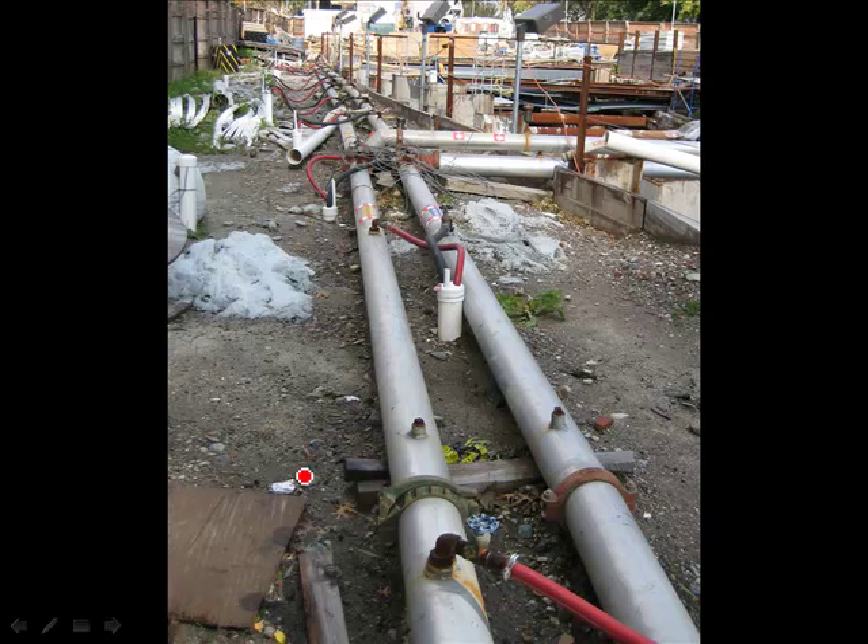This illustrates a different system — this is an ejector system or an eductor system. This is one of the wells, and it works on a different principle. High pressure water is pumped in, pumped down to the bottom of the well, where it goes through a nozzle which creates a venturi effect, which in turn creates a drop in pressure, and it actually draws water out of the ground. So you get high pressure water going in, and you get the spent water coming out — but you're removing more water than you're actually pumping in, so the net amount is actually dewatering the site.